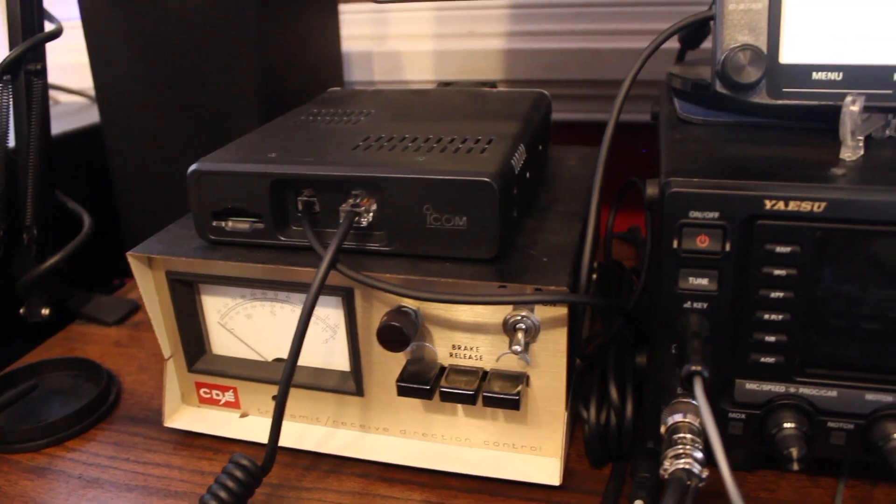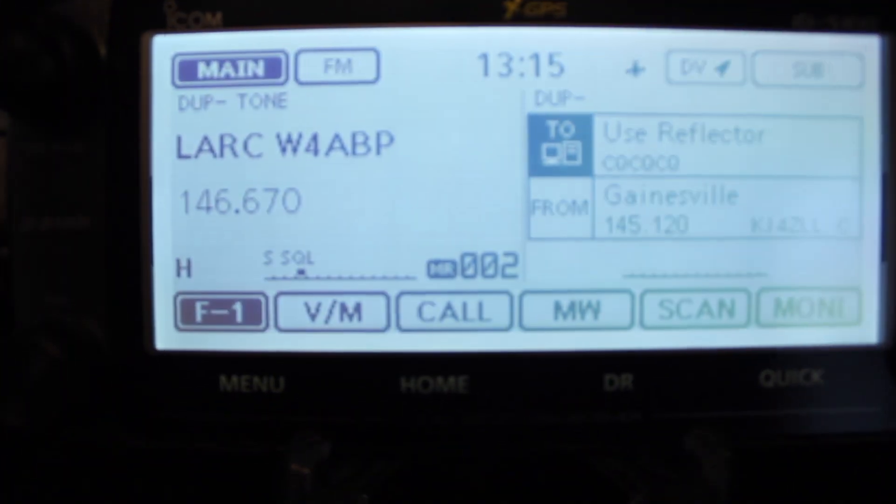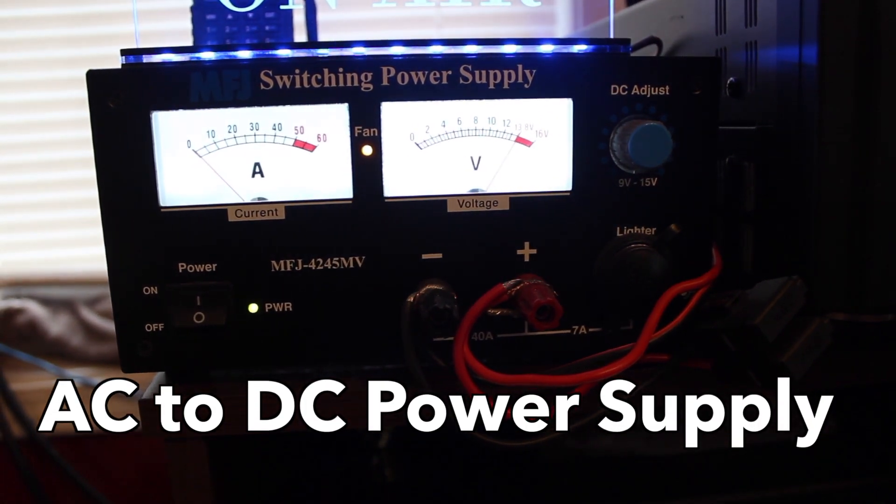So what would be a better way to get started talking? One of the best things you can buy would be a mobile ham radio — something that can transmit and receive on the bands you want, with enough output power to have a reliable signal into the repeater. Mobile radios are designed to be installed in an automobile, which has a 12-volt DC power source. But when you first get into ham radio, you'll probably want to install it in your home, which means you'll need a reliable power supply to run your 12-volt DC radio from your 110-volt AC mains. Look for a supply with the correct 12, 13.8, or 14-volt output with enough amperage to power your radio. If you're not sure how much amperage your radio needs, check your owner's manual.